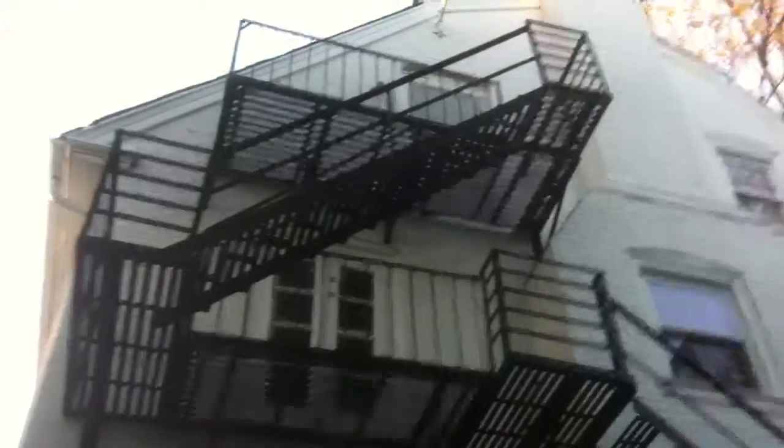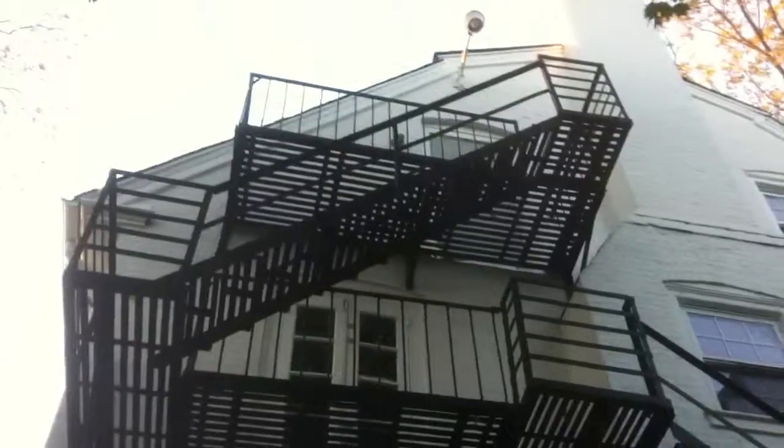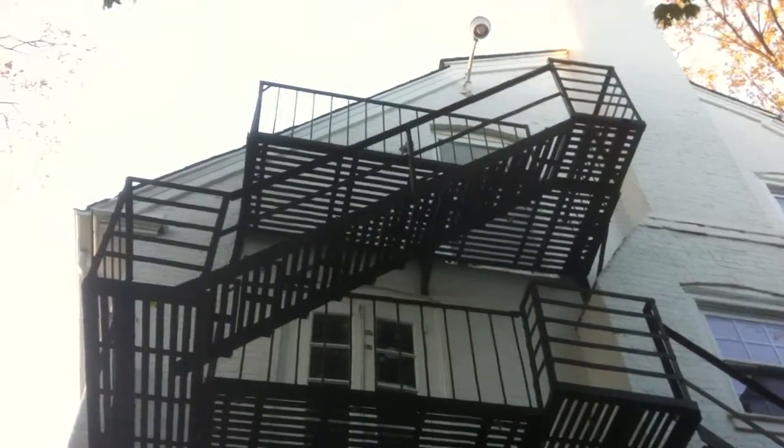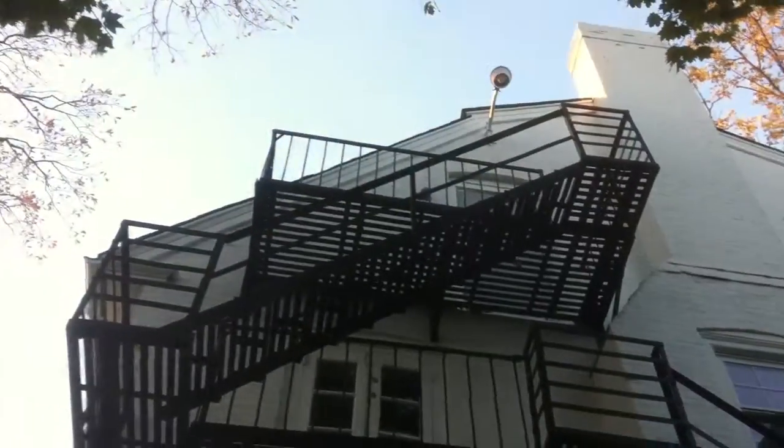So I'm looking at this fire escape overall to see if I see any evidence of any rebolting of any kind, any reinforcement of any connection of any kind. And that's usually identified by a hex head bolt. Can't see any. So let's come down to, I'm not going to climb the fire escape, but there's some things right down here at ground level that I can look at, and look at these treads.